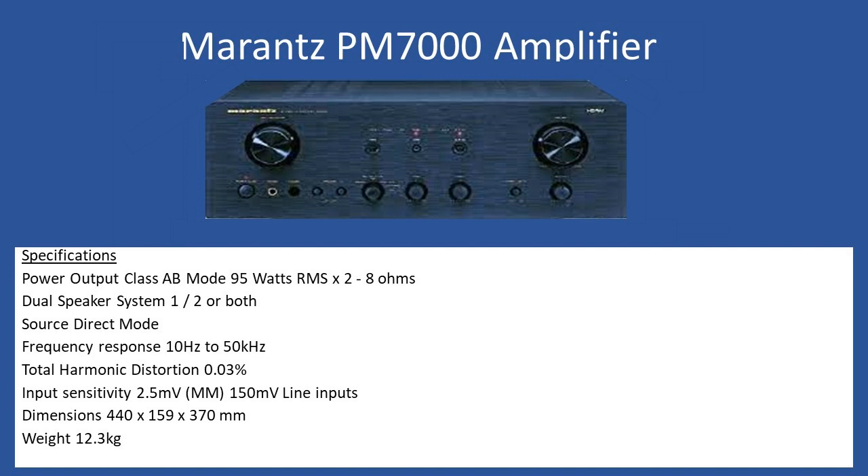You can go and repair the fault, but you need to do a lot of remedial work to prevent future issues. Looking at the underside of the amplifier there is a service plate — you can snip off the metal tabs, remove the plate, and get access to the solder side of the amp board, though you don't get full access. Thankfully this amplifier didn't have that service plate removed, indicating no one had previously worked on it from underneath — good, because you're only repairing the fault that occurred.